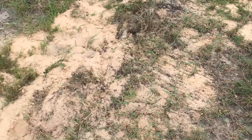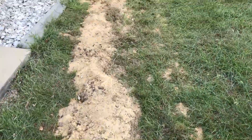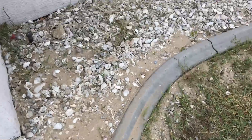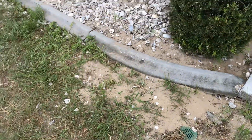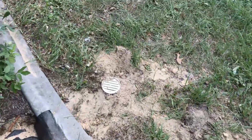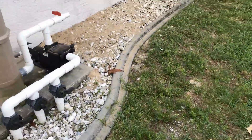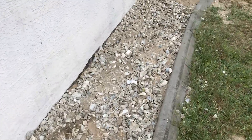We've got it all backfilled. Here's one discharge point — it has to discharge to daylight, so it runs downhill. This is the footer pipe drain running all the way back. It'll settle in after a couple of rains. Shell is back with a little sand that'll wash down when the big rains come. The two downspout drains come right out to pop-ups to get that water out of the bed and prevent flooding. We hooked up this downspout to a pop-up at the back as well. By the pool, it's all backfilled — shell in, downspout goes to a Y and discharges out to daylight at a little grate.